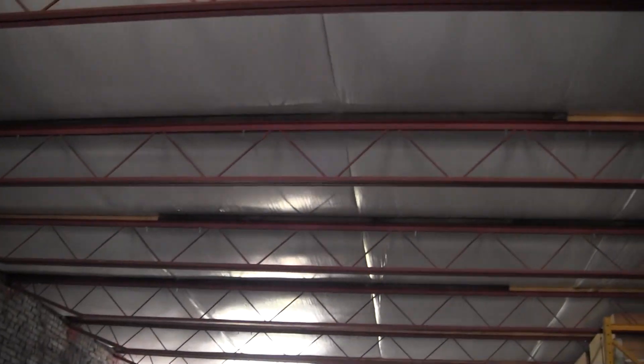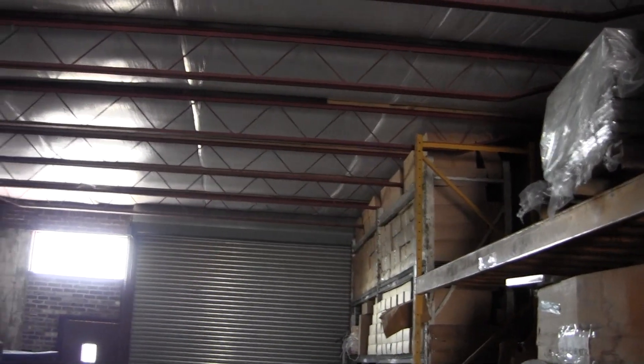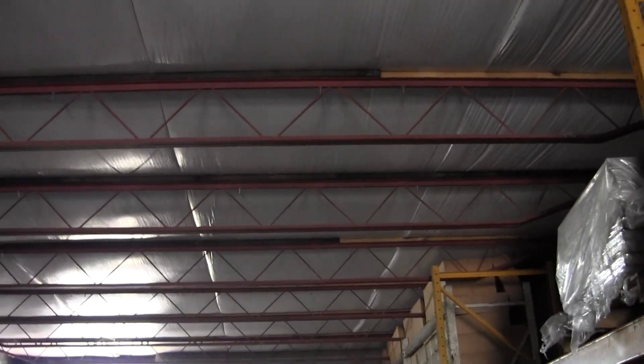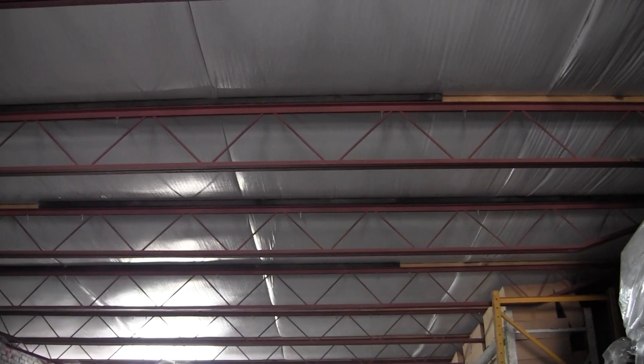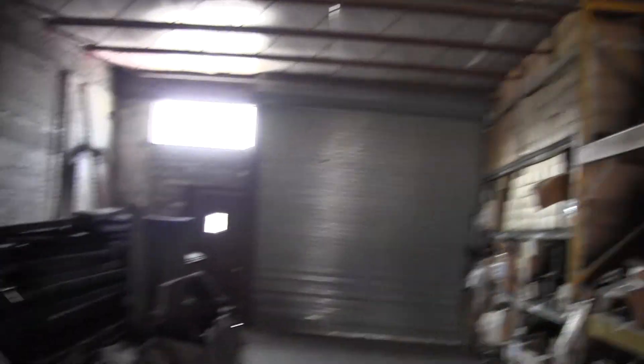When I got off this roof I thought I put that last screw in and said I'd never see that roof again - it was the first one to start leaking. I left wood up there and screwed into it, which they told me I could do, but if it gets a little bit of moisture that screw rots out the wood, your roof gets soft, and you can't just put a screw back in rotten wood.